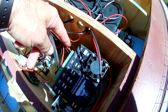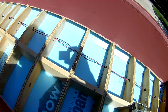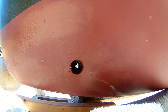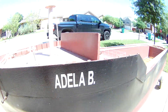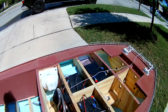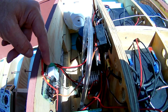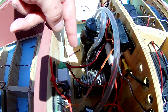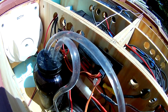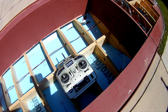Right now it's basically powering the main motor itself and also the bow thruster that runs along there all the way up to the front — it's inside there. It does push the boat around but it's very slow, so I don't use it all that much. Once it comes into the power distribution panel, it comes out to this motor controller here that goes to the main motor down there, and it also goes over here to my RC receiver — this is basically just a four-channel Futaba radio, so it's pretty simple.